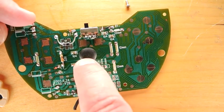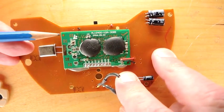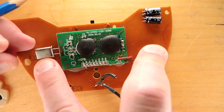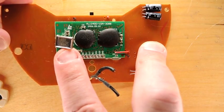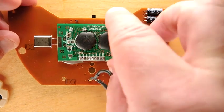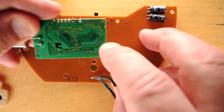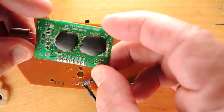This blob here is a chip-on-board, so obviously something is going on there. More interestingly, there's actually a fiberglass circuit board here with two blobs, which of course are two more integrated circuits. There's also a crystal, and this is exactly the color burst frequency part of an NTSC design — a color burst crystal so you can create the right colors. It was just glued on with some adhesive and then soldered through. Let's take all three of these off and look at the silicon.